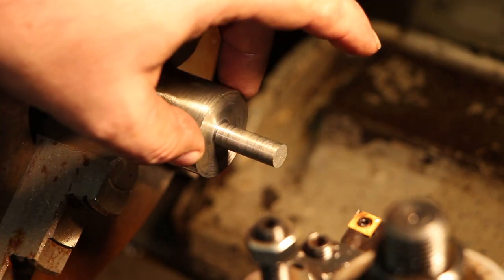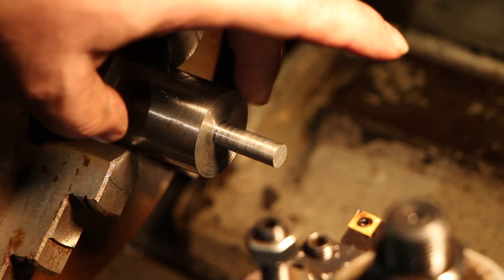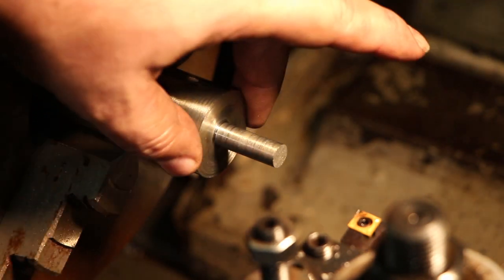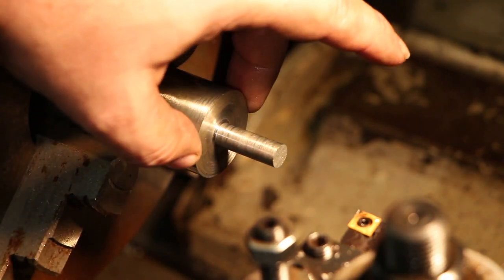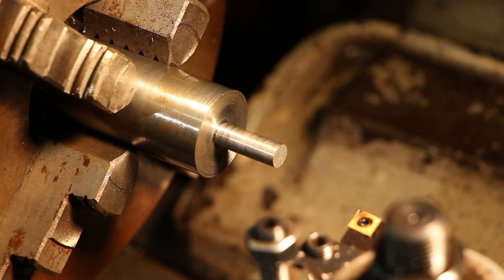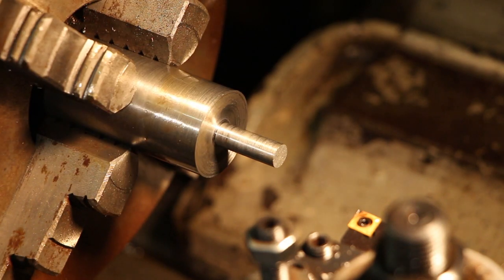And that's just a common practice when you're putting on a grinding wheel. You really want it pressing just on the outside ring and not on the inside, so that you have a good contact, particularly if there's something on that inside that's not letting it clamp up good and tight. So that looks good. We're ready to put some threads on there.